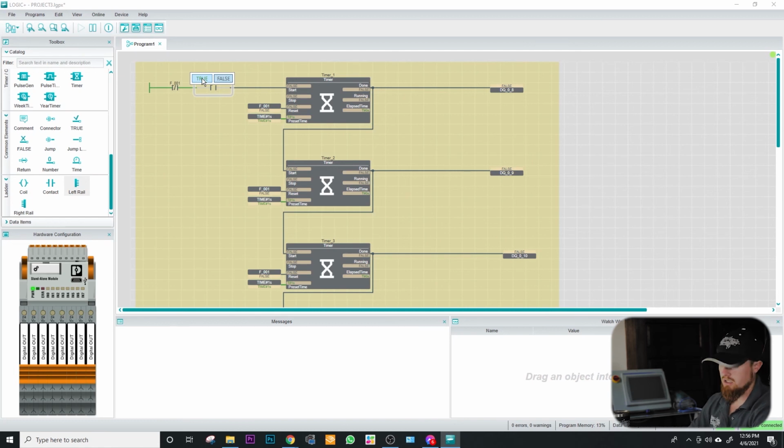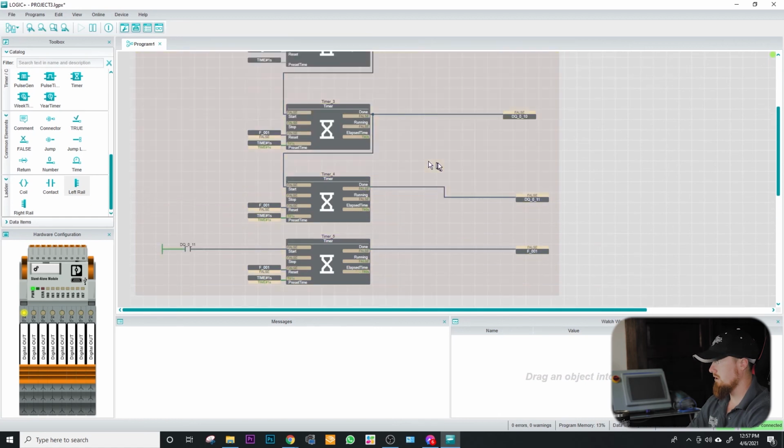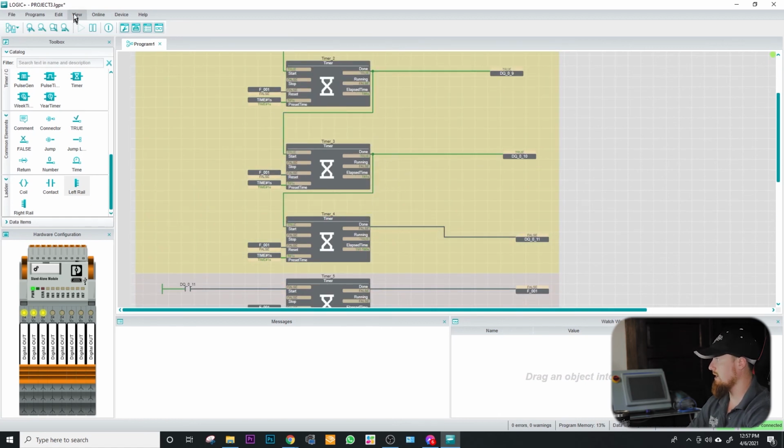Because I've run through times in programming code where maybe I'll put a timer on something, and you'll notice that that piece of logic is not actually firing one time, but it's actually firing like 6 times. But on your graphical interface, it's only showing one time firing. So something like an add function or a timer could be very good for troubleshooting. So it looks like it performs the exact same way.